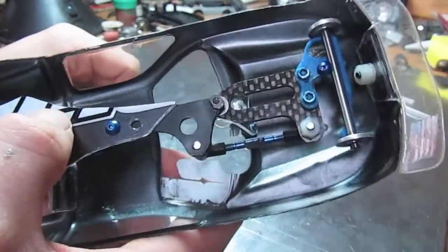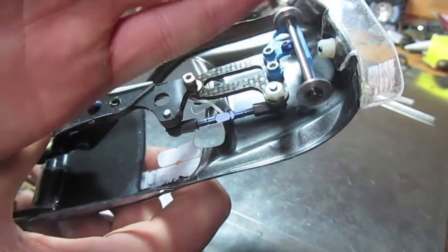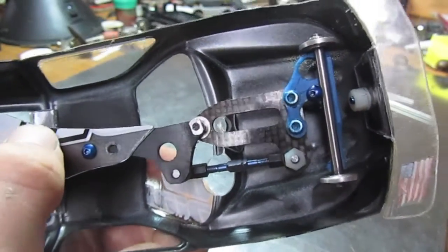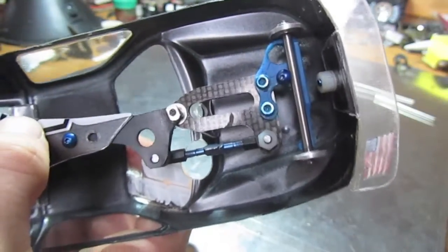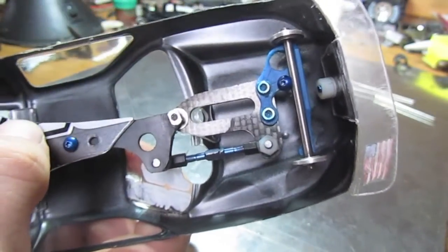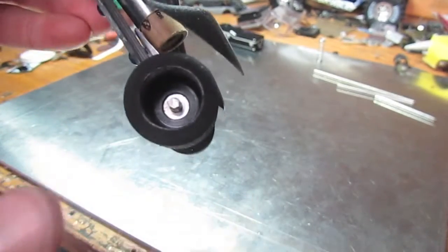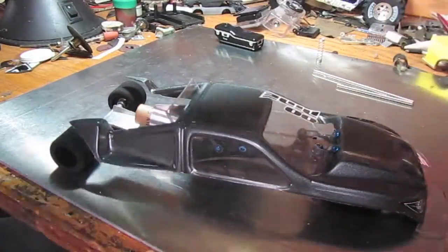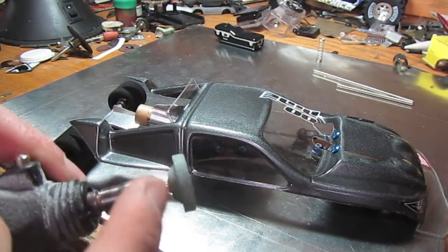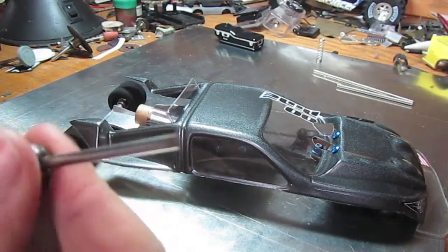Another thing to do is put in adjustable steering. I use a turnbuckle from an RC car — as you turn it, the axle will slide left or right, allowing me to guide the trajectory of the car. It only guides it because the wheels are aluminum; if they were foam it'd be a lot more finicky to dial in. I made the front wheels myself by taking the rear wheels and trimming all the foam and aluminum rim down using a 1/8-inch rod mounted in my Dremel — which is coincidentally the same size as the axle — and just ground the wheel down like that.